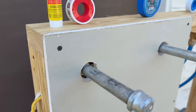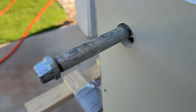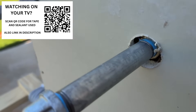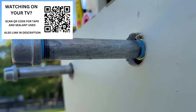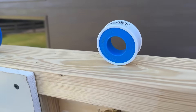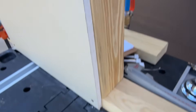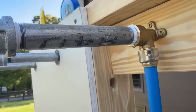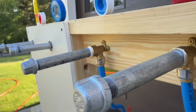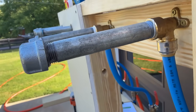Starting with the old favorite, Teflon tape and pipe dope — looking at the threads we don't see any drips on either end, so that one has passed. Blue Monster also looks good. Now Teflon tape alone — 50% of you guys just use Teflon tape around the house — that is not looking good. We have a drip at the bottom, a slow leak, classic especially at the shower arm fitting. That's a classic DIY mistake. And then our new competitor, Loctite 55 — no drips on either side.